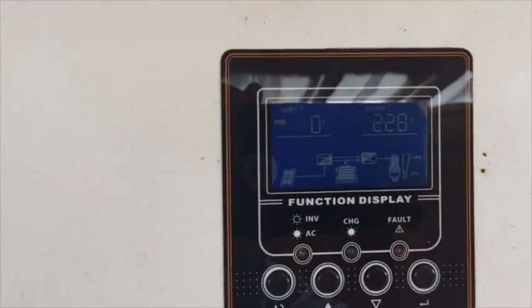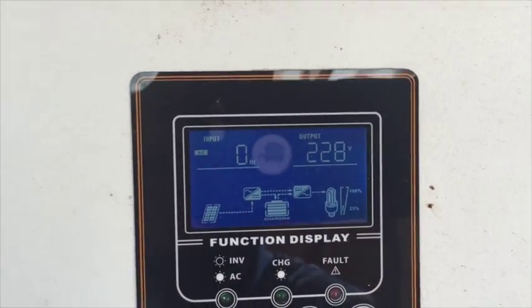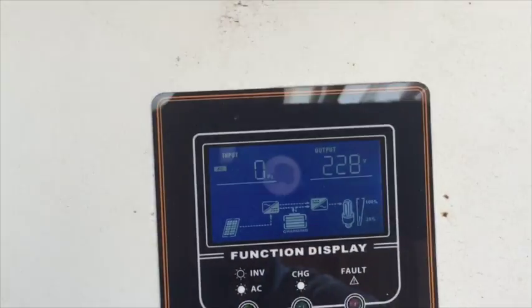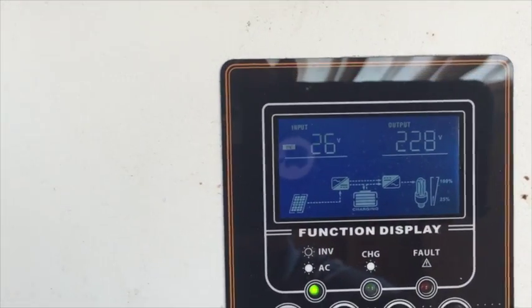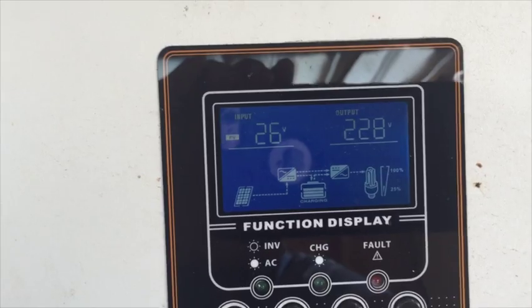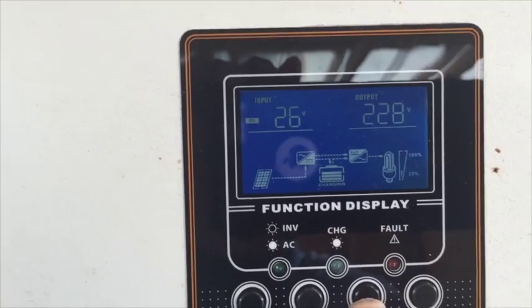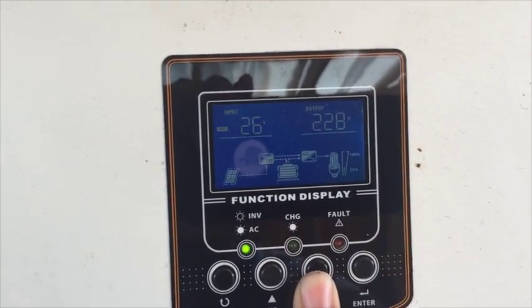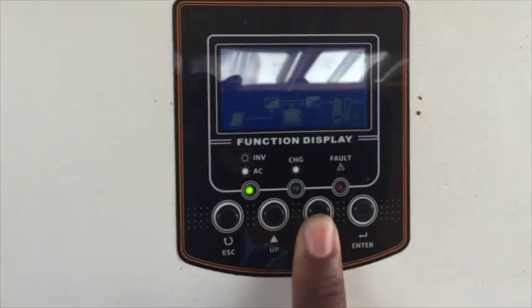These monitors are very inaccurate. I don't think the shunt is calibrated — they might not even have a shunt; they might just look at resistance. The power in and power out readings are very inaccurate. I do have an amp meter clamped to the solar side coming in, and I'll see three or four amps before the PIP or MPP Solar picks up. I also have a DC-DC gauge coming in so I can monitor power in a little better.